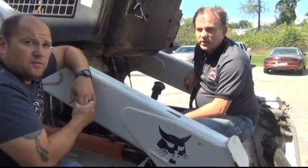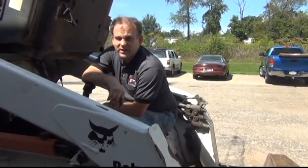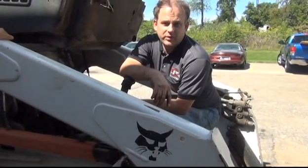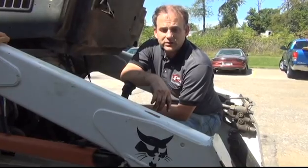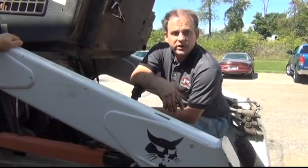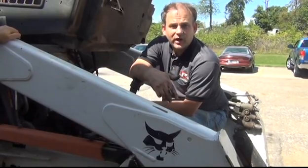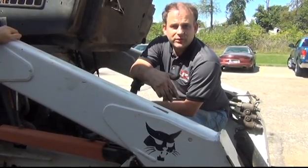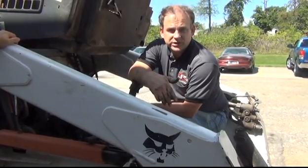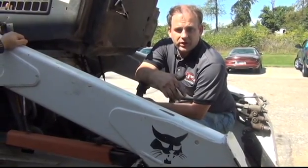That's really important if you own a machine or are looking to buy one. If it's driving a little bit slow on one side, that's your first indication that you have a pump or motor going out, so you want to treat that with respect because it could become very expensive. Pete mentioned the left side was a little slow going forward. I had previously drove the machine and noticed that too, but in reverse it was still okay, so I had reasonable assurance that the pump or motor — the expensive stuff — wasn't the problem, and I could feel good about buying the machine.